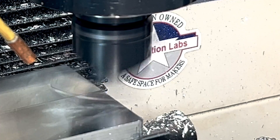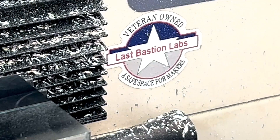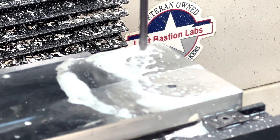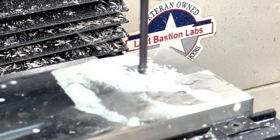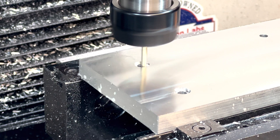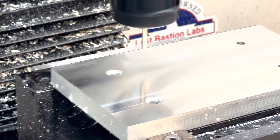We're starting off on the back of the grips. You may have noticed that my stock looks a little thick — I'm using some scrap that I had left on hand. I'm removing the bulk of the material with an 11/64th drill bit, before running the boring operation for the counter bore in the through hole.